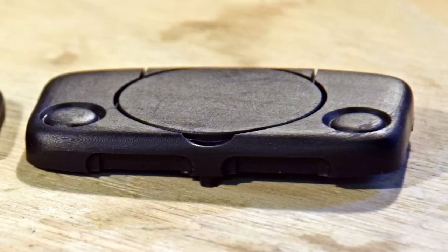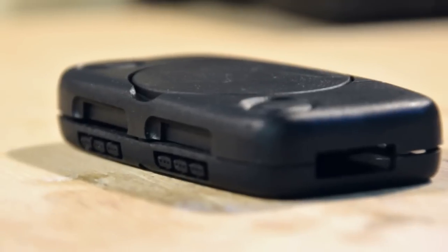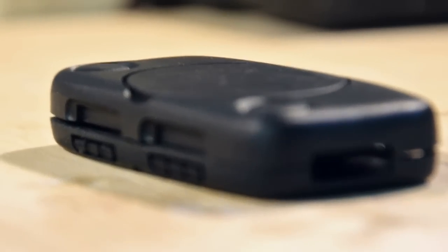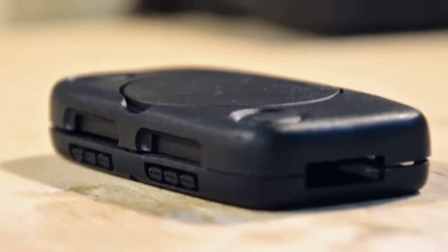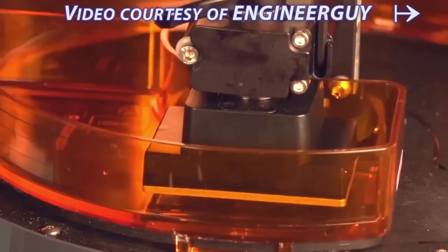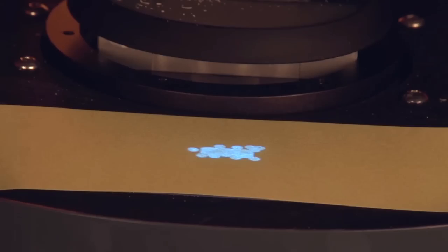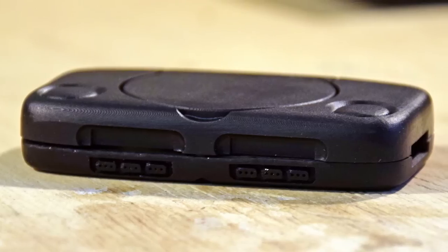It's important to note that the 3D model was slightly revised before this print — the lid cutout was made a bit smaller, amongst other things. SLA printers are very different from classic 3D printers. In this process, a liquid resin is locally solidified by short bursts of UV light. Since the focus point of the light can be very concise, the prints made using this method usually have a high level of detail.